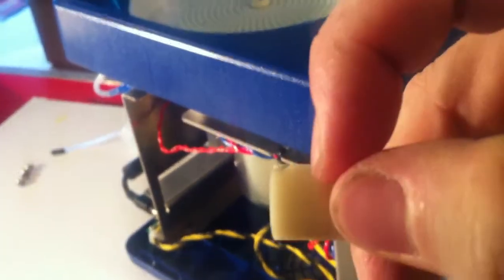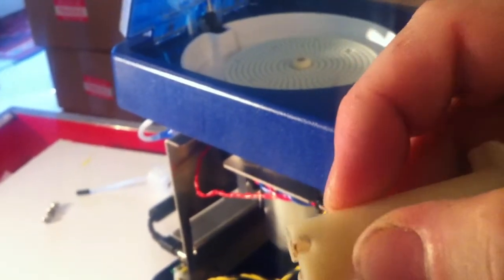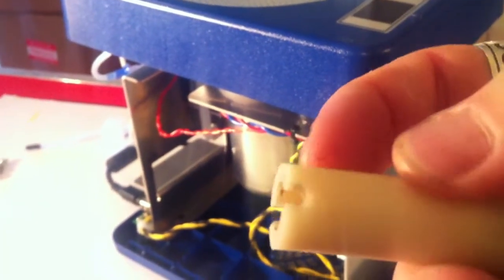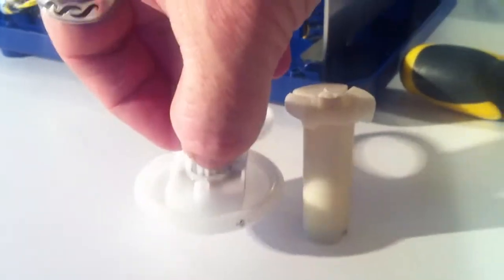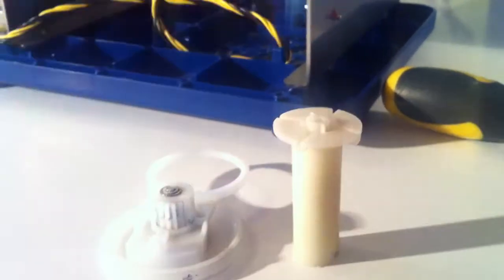So sometimes you'll see, if a pump is stalled, you'll see a little groove where the shaft is here. And for some of you that have had phone fixes, if you get a groove in there, to get you going, just briefly you put a bit of sellotape around this part here where the groove is, just to make it a little bit thicker, which means this O-ring here presses up against it more securely, and then runs the pump briefly until we can get you serviced.